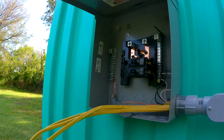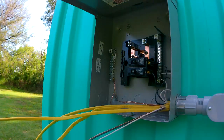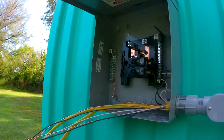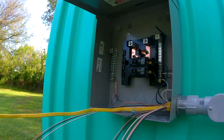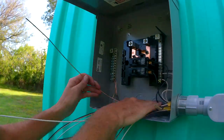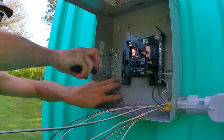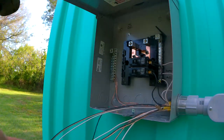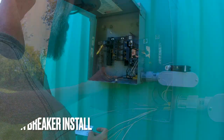Don't be stingy with the wires in here. You want it to look clean — make sure you label as you go, you can see the Sharpie on the right-hand side. But don't be stingy: leave a little too much wire. You want it clean and you don't want wires looped everywhere, but if you have to move or change something, you're screwed if you don't have the wire to do it. I was running it up alongside the box and then into it — comes out looking pretty clean but also leaves plenty of wire if I need to move something. Same with the grounds — run them down and then up, so you can move them around if needed.